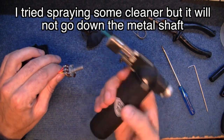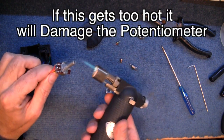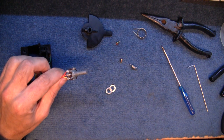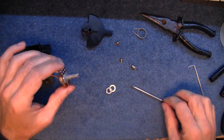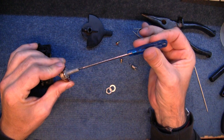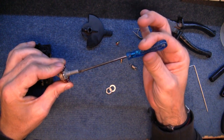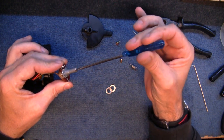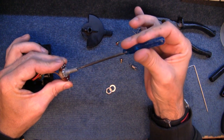This is just a cook's torch, and I'm going to gently warm just the top of the post — nothing below. If I get that a little bit warm, that should loosen the old grease a little bit. If there's a bit of crud inside the grease — you see, it's moving really easily now, just two fingers. Trouble is when it cools down it will start to stiffen up again, but hopefully if there's a little bit of crap stuck in there that's stopping this from moving, I might be able to get it out of the way. So just keep doing that until it cools down.